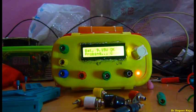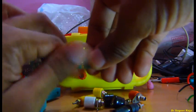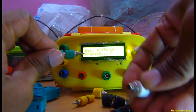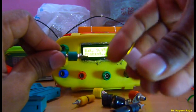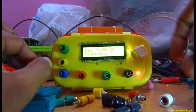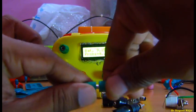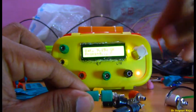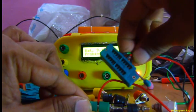Nowadays different types of binding posts are available. Here I have used this threading type of binding post. There are different types — this is another type with a soldering tack behind it. This is a 10 ampere binding post, and this one is 15 ampere. I have used the 15 ampere here so I can easily connect the wire into this slot. You can see a slot here — we strip the wire end and insert it, then lock it by simply turning it.